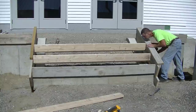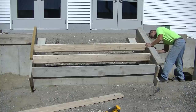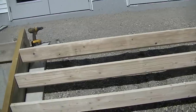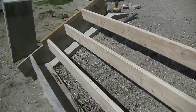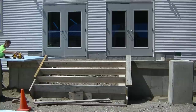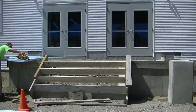I'm getting my risers screwed up where I need them. You can see how I started at the bottom and each one goes up seven inches until I get to that top platform. That top board on the right is the same level as the top two-by-twelve that I first tapconned down. The platform runs out into the stairs about a full step width.